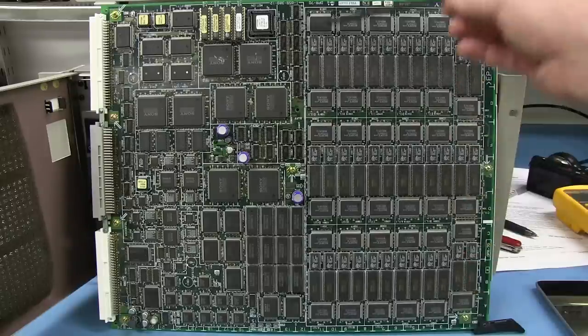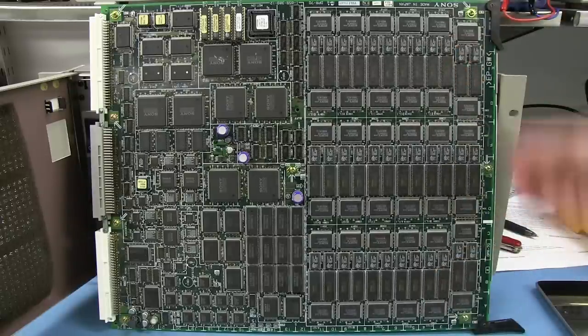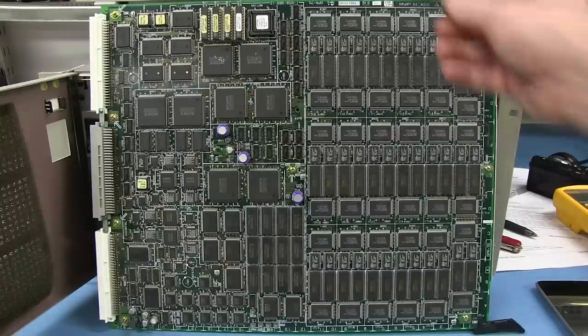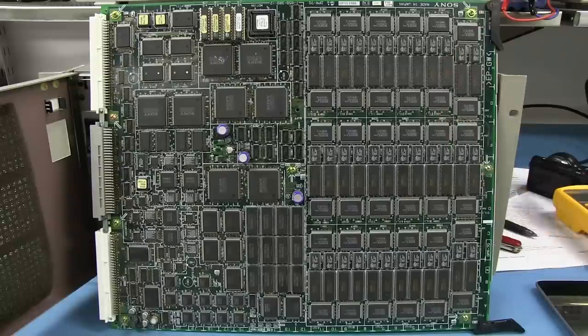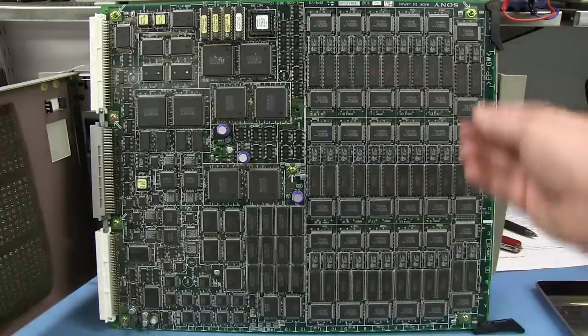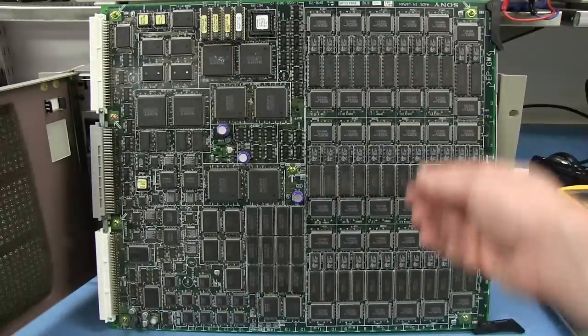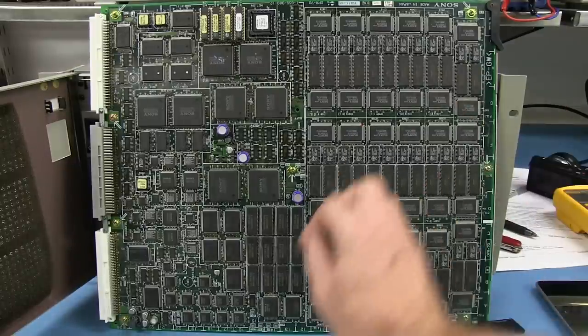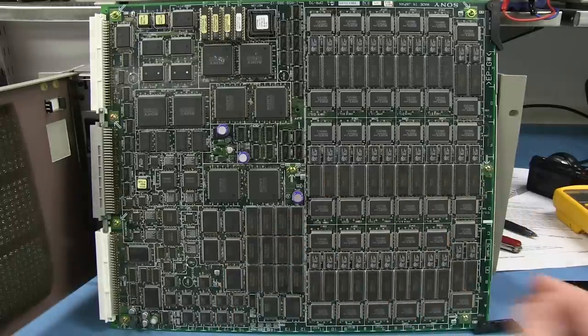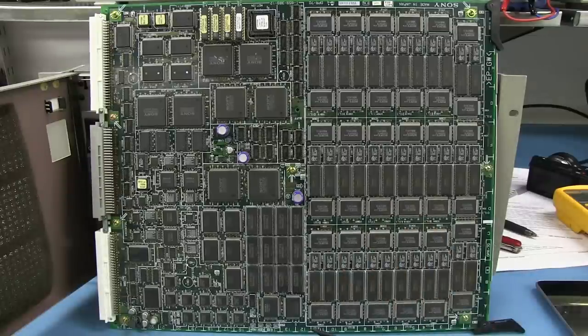And then once you've got, okay, I've got half my board dedicated to all these duplicated channels, and I've just got enough room left for these, and you place that. And then what happens if you place all these and you go, well, I needed an extra inch or half an inch on the board? Oh, you're screwed. But these things generally come together in the end, and you usually don't end up with that, because while you're laying out stuff and placing all these parts, you've got it in your head how much general area you've got available.